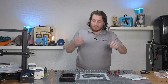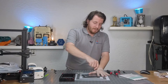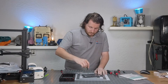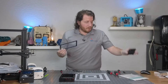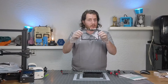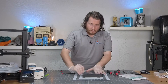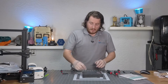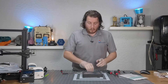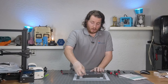Now that you have those done, you're not out of the water yet. You still need to poke a few more holes — bigger Allen keys are going to be tough, so we'll do it with a knife. Okay, now we no longer have a need for the tensioning tool. You're going to bring your tank back in — put it so the chamfered side is facing up, stick it where it belongs, and then push your bolts in. This is where torquing is really going to matter: if you tighten one side more than the other, you're not going to have an even stretch on that FEP, and that's not going to work all that well for you.